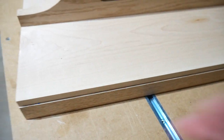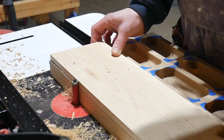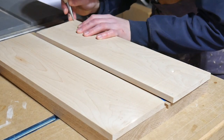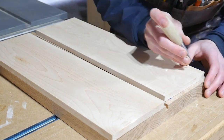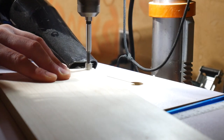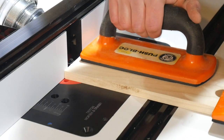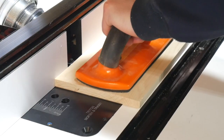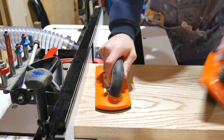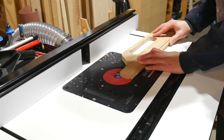Here you can see that slight offset from center created an overhang, which I didn't notice until this point. The funny thing is it was actually compensated for on the other side, so using a flush trim bearing to cut that off actually made them even — so that kind of worked out nice. I could then use an awl to mark out the holes, and I'm going to be drilling some small holes with a Forstner bit to glue in some 3/8 inch neodymium magnets to hold the lids down to the tray. I then put a chamfer on the bottom side and a round over on the top side of the lids, and do the same to the main tray — applying a chamfer to the underside and a slight chamfer to the top side. That way when the two chamfers meet, if there's any misalignment between the lid and the tray, it'll be hidden by the chamfer.